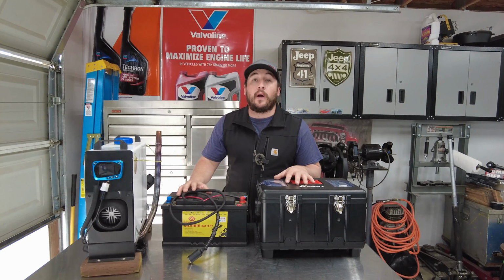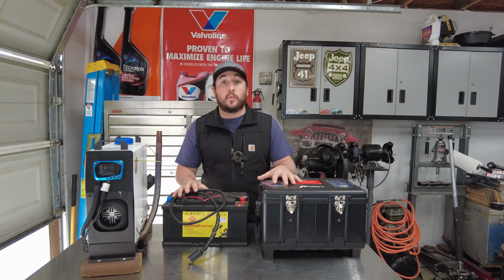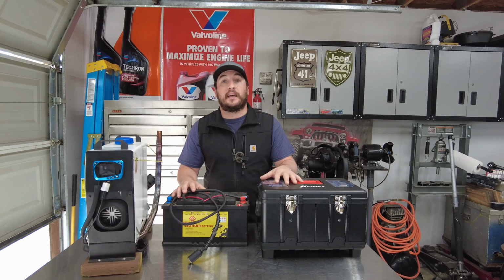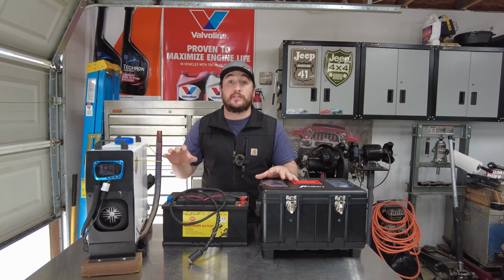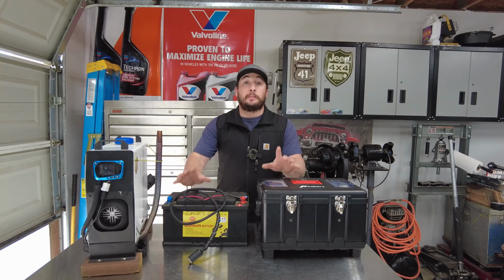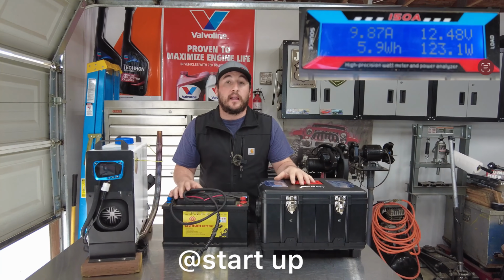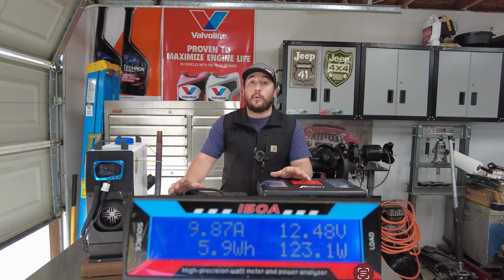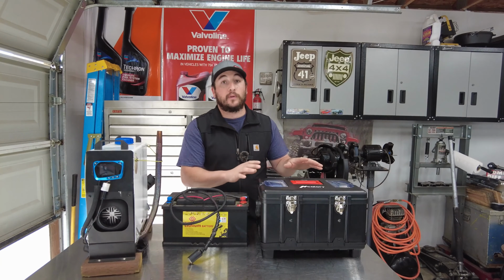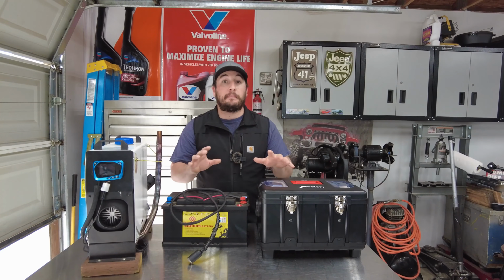Before I let you go, I wanted to give you some perspective on how many amps these things require. This will help you decide what size battery you need for the length of time you're going to be using your heaters out on your adventures. At the beginning of the video, I recorded the full load amps on the screen, and I recorded somewhere around 9.87 at full load for this heater. Do keep in mind that may vary based on the ambient temperature.